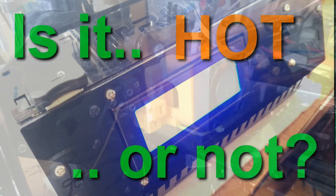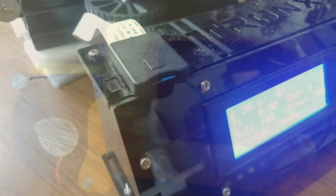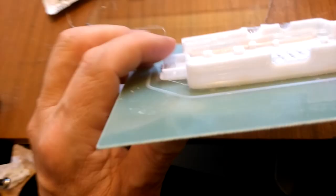Since then I've replaced the stock metal cowling with a plastic one, and that allows me also to fit a hefty part cooling fan when the need arises. I've added an extension to the SD card reader so I can more easily access it. The stock power brick — or fire brick as I called it — overheats terrifyingly; I made a video about how to tame that.